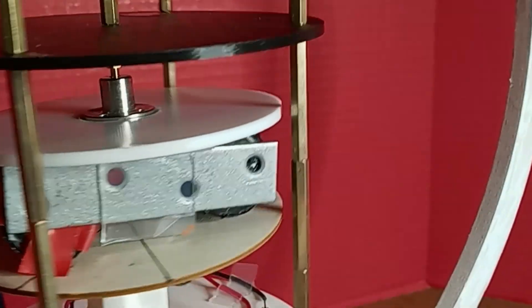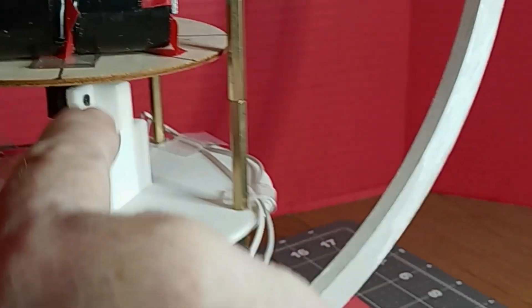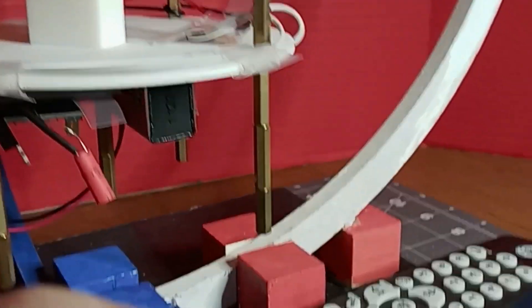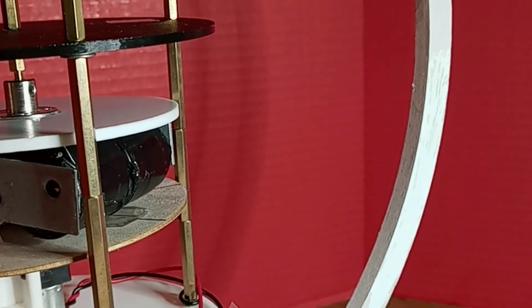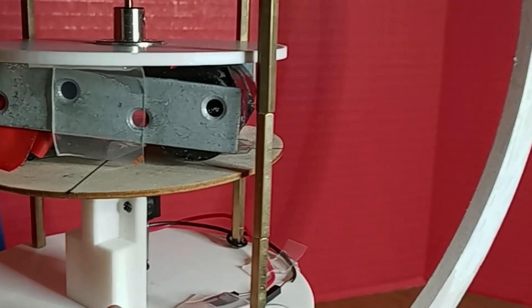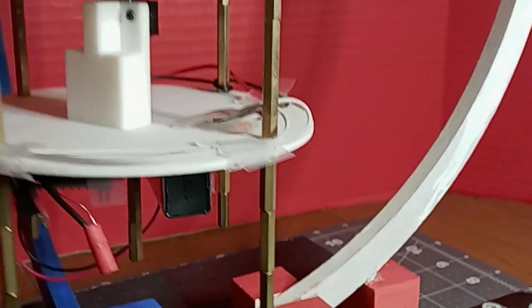I've gotten the motor to go up to 390 RPM. What happens is the magnets are turned by the electric N20 motor — a 1000 RPM N20 electric motor run by batteries and electronics underneath. When the magnets turn, because they point north they stay still and the rest of the armature turns. That's the concept here, and it would be applicable to something in the water or something in space where you need to turn without pushing against anything.